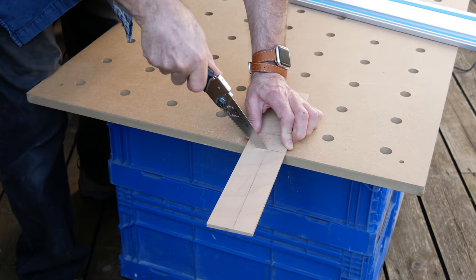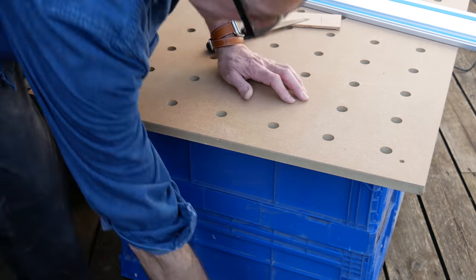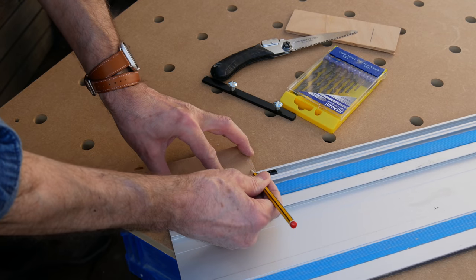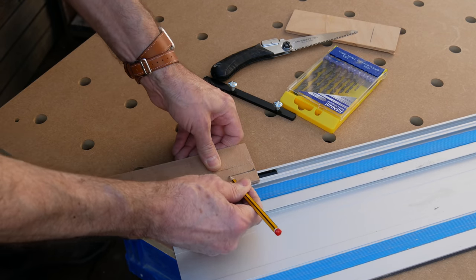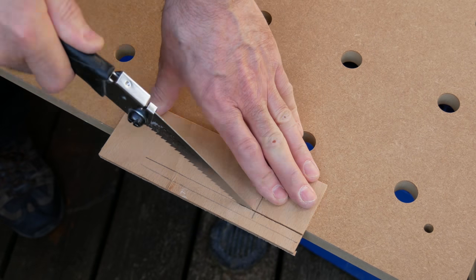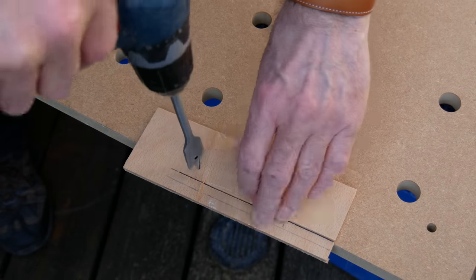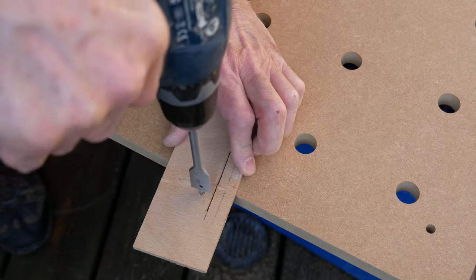With the front set aside for the glue to dry, I'm making my Dave Stanton style dog locks using an old guide rail connector bar cut in half, a few scraps of 6mm ply, and a couple of pairs of roofing bolts cut down to fit. It's a super simple idea where the slight wedge shape cut into the plywood ensures tight contact between the bench dogs and the rail.